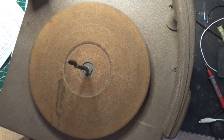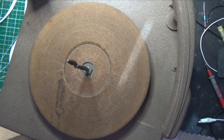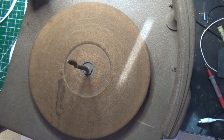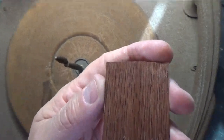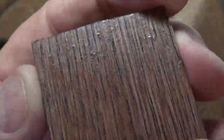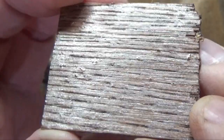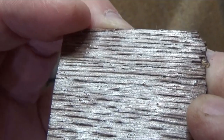And we're also going to work on the cabinet. So on the cabinet, one last thing before I wrap up. I was not going to use grain filler. I didn't think the grain was deep enough, but now that I've basically stained a piece and urethaned it, this is what it looks like. I've stained it, urethaned it, a couple of coats, and you can see here that it's not smooth. The grain is not so bad, but I'm thinking for the top of this thing I want it to be a little bit more like furniture. So I think I'm going to do some grain filler.